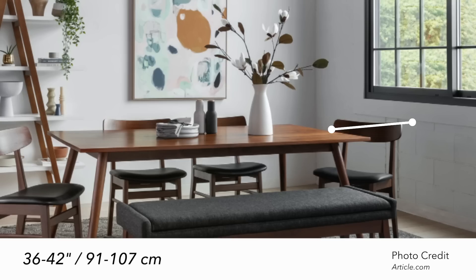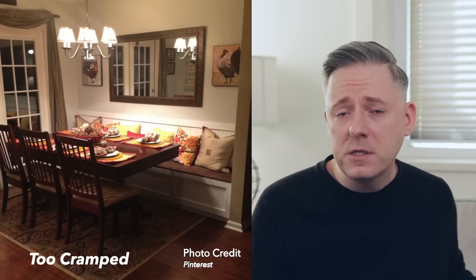Measurement number seven: the dining room table to the wall should be about 36 to 42 inches. The important part is making sure you give at least that 36 to 42 inch clearance so people can get in comfortably and seat at your dining room table. If you can't fit a good-sized dining table while still allowing for that clearance, I recommend considering a round table. Round tables give up some real estate but make up for it in ease of flow — people can get in and out more easily. You're still looking for 36 to 42 inches from the edge of the dining room table to the wall.